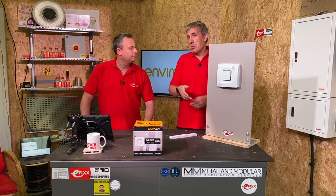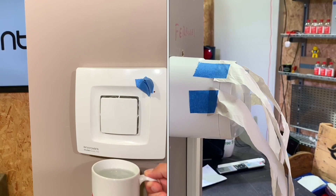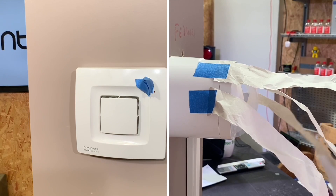In intermittent mode, when there's nobody in the bathroom and no humidity detected, the fan is off. When somebody introduces humidity or movement, the fan changes its status. Let's introduce some humidity with the eFix Apprentice Hub mug — some nice steaming hot water. You'll see the fan has immediately detected that and switched on.